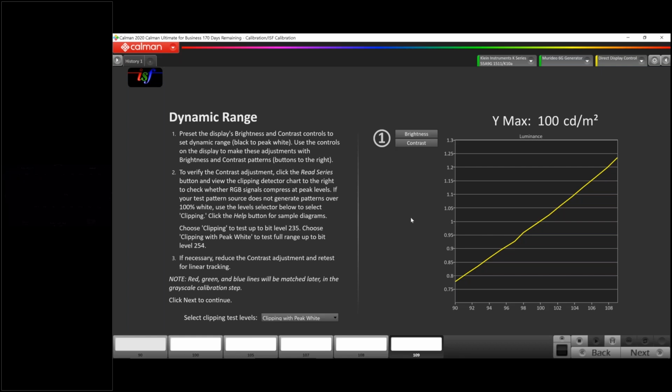So you'll notice the first box starts with number 17. The last box is number 26. So I want to at least see 17, and I can't right now. The darkest box that I can make out with my eyes is right about 19. So I'm gonna probably have to bring the black level up just a little bit to squeeze out 18 and 17. Now there's kind of a balance here you have to be aware of.